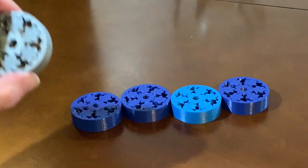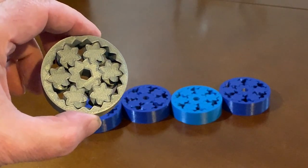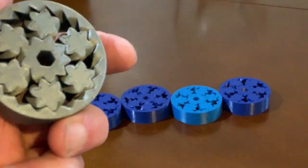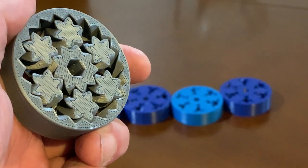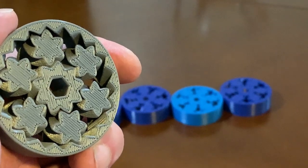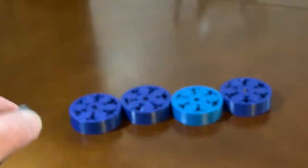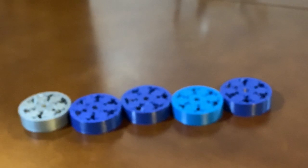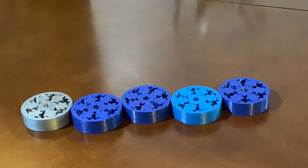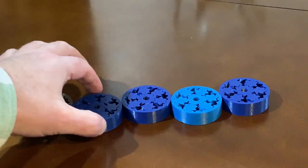The day that I got the printer, I had one spool of PLA - the silver PLA that came with the printer - and I printed this gear bearing because it was one of the prints on the SD card. Many people noticed when I put it on the video that my Live-Z was way too high, and you can see that on the bottom layer. I had to lower my Live-Z in order to print the castle that was on the SD card, and I ended up printing at around negative 600 for quite a while, getting a lot of really good prints.